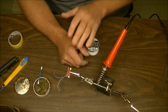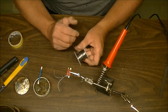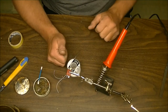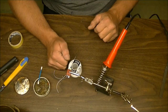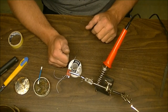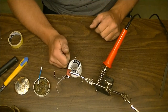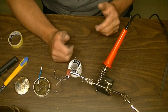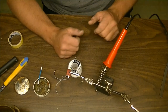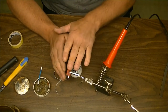I'm going to show you how to prep a brand new connector properly. A couple things you need: a soldering iron — usually about a 15 to 30 watt iron is more than effective for about 80 to 90 percent of RC work. For fine circuit board soldering you'll need lower wattage irons with finer tips, which we can cover in another video.